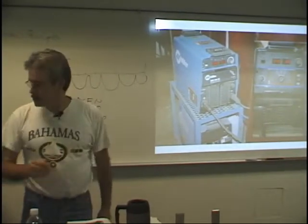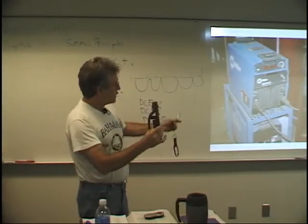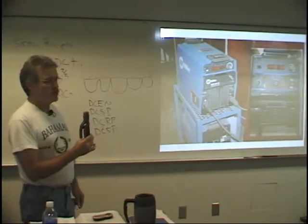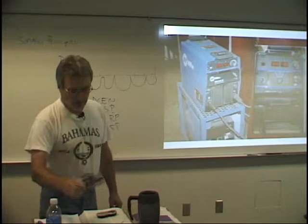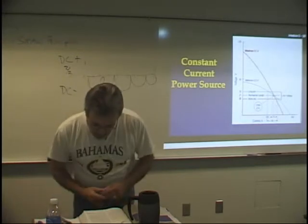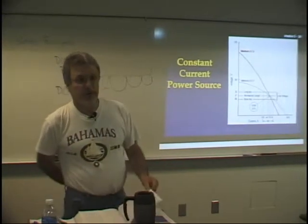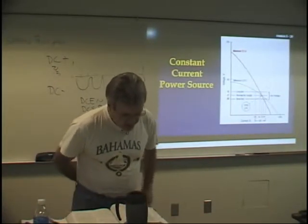First thing you do is you pick up your electrode holder, and you trace it back to your machine. And you always think straight line, straight polarity. So you can check that. Don't ever get fooled by that, because it will happen to you during your welding career. Okay. Any questions? Nope. Okay. All right. So now, you will get a question on which side produces the greatest amount of heat and things of that nature, so be aware of that.